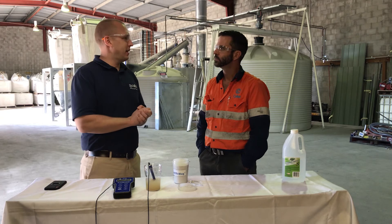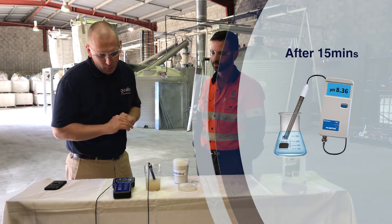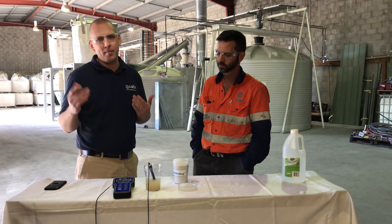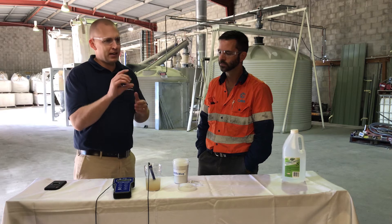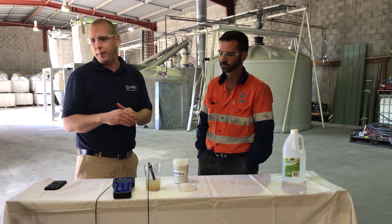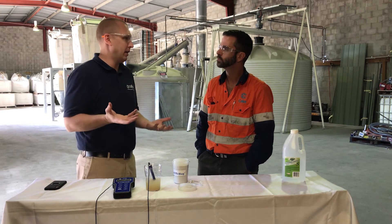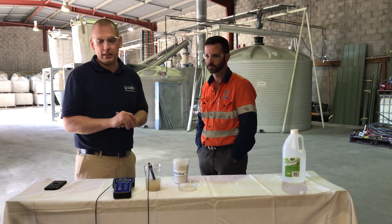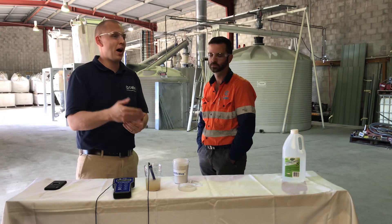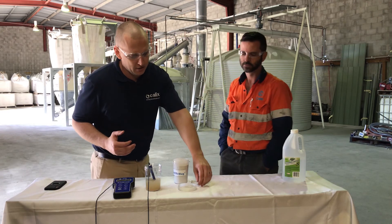So we're just on five minutes and what we've seen is it's buffered out at about 8.36, which is fantastic. Unlike the caustic, where adding just a little bit more sends the pH skyrocketing. So if you accidentally add some product to your network, you're not going to have bad consequences. What I'm going to do now is add another six millilitres — a 100% overdose — and see what actually happens to the pH.